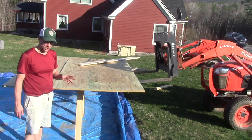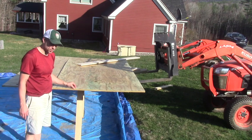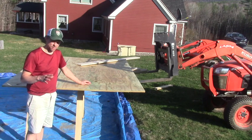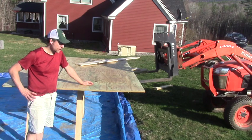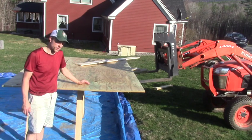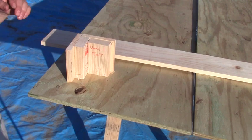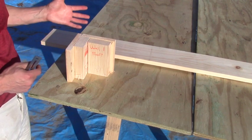Now the only difference is that you're going to leave a little bit of a different gap on the edge when you put the 2x4 stud. And I'm going to do a close-up video of what I'm talking about with the little simulator blocks, because the key here is that the two sides have to come together tightly so it's weatherproof. And I'll explain what I mean in a video in just a second. Okay, so this is a little close-up demonstration of what I'm trying to communicate about the edges of these walls.